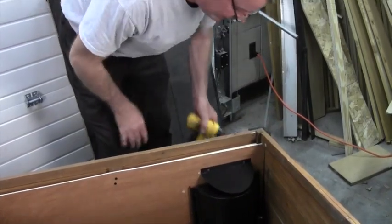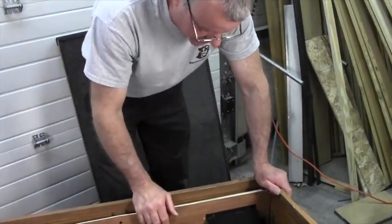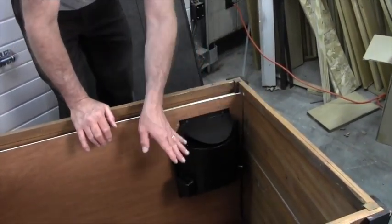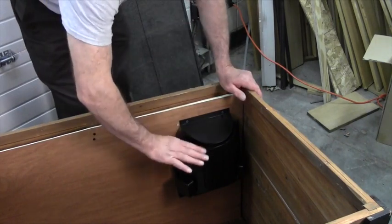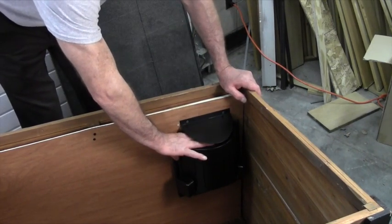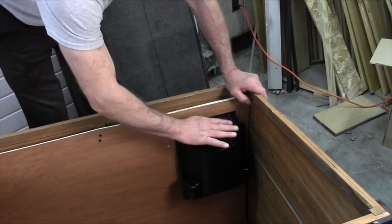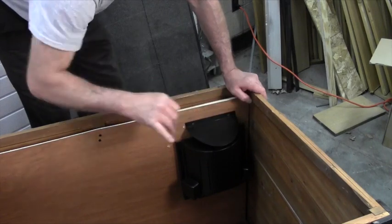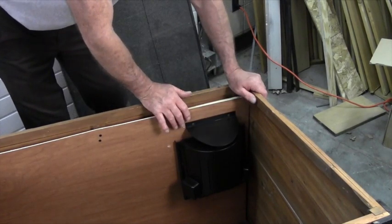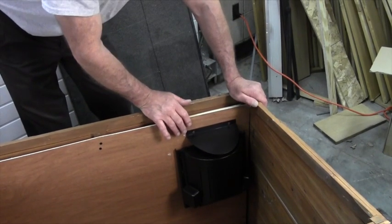I've now completed the final step in the installation process — putting on the heat shield. This deflects the heat away so it spreads out inside the house and protects the roof. This gets extremely hot — 160 degrees, like really hot water. Not hot enough to do any kind of damage or be combustible, but it's still nice to have that break so the ceiling doesn't worry people. In reality, it's not even close to a combustible temperature.